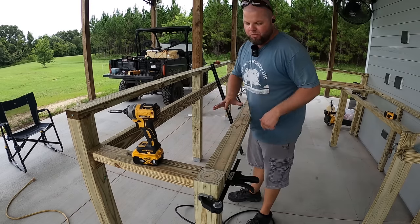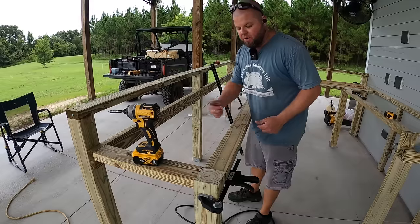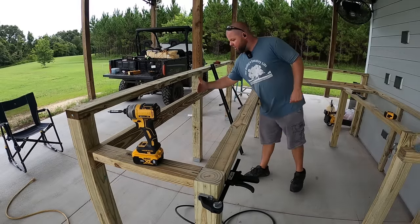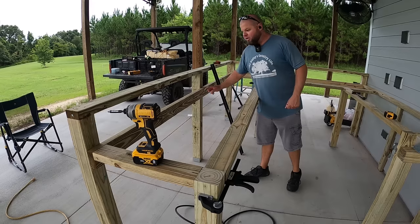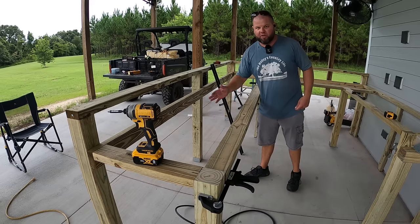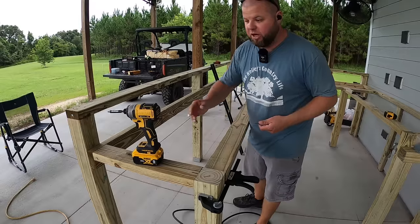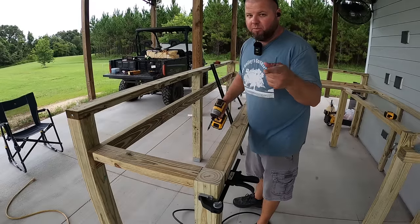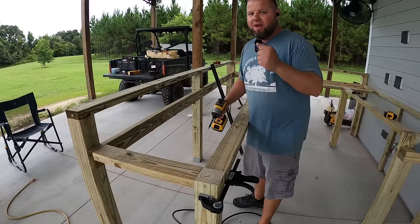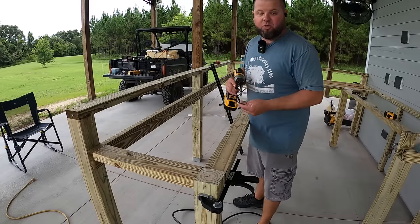So you can see I'm being a little odd with the way I'm laying out some lumber. Some of it I'm laying flat because I'm gonna do almost like stud framing down here for all my doors. And then some of it, I'm putting it straight up and down like this to get the strength for the plywood that's gonna lay up here, then the cement board, then ultimately my tabletop, which I forgot to mention to y'all. We've decided to go with tile, but I'm doing it in a unique way, a special type of tile, and I'm trimming it out in a way that I think it's gonna be DIY friendly and look good, not just like your standard old tile countertop.